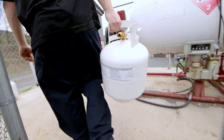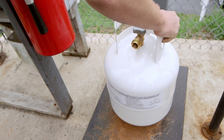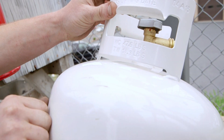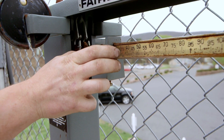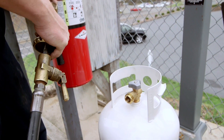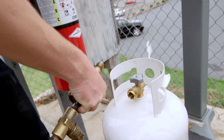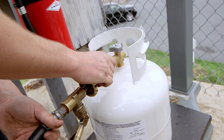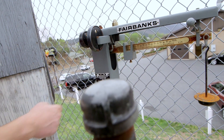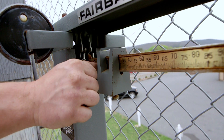We're going to bring the propane tank into the enclosure and then we're going to weigh it. The TW means tare weight, which is the empty weight of the propane cylinder. We're going to verify that the tank is empty and ready to be filled, then hook up the filling hose and weigh it again, adjusting for 20 pounds since we verified the tank was empty with the scale.